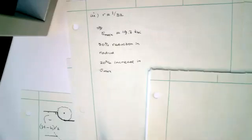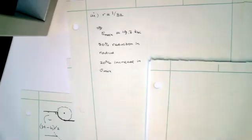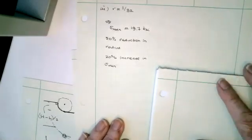Now that was bending, and the outside plane there where the maximum bending stress is acts very similarly to tension. Okay? It wasn't markedly different. It was different, but there are other cases where bending is radically a different thing from tension. Let me do one of those so you can see that.